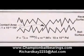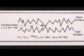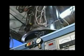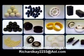Normally, an incompressible fluid fills in the valleys, keeping the peaks from touching. If your system cannot tolerate conventional lubrication, micro-weld adhesion will occur. By using races with fewer valleys due to a solid-film lubricant applied with an ion deposition process and incorporating silicon nitride grade 5 ceramic balls — ceramics do not weld to steel — we can provide a superior product.